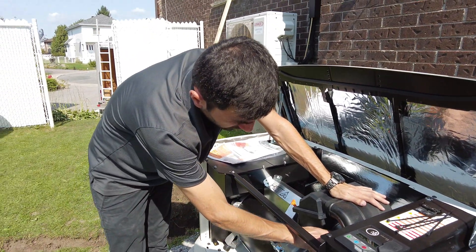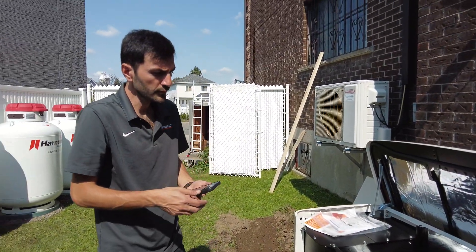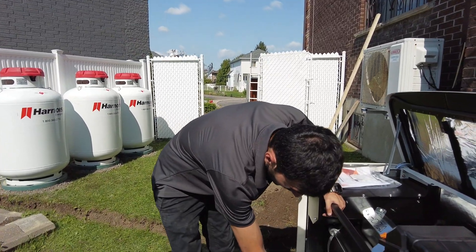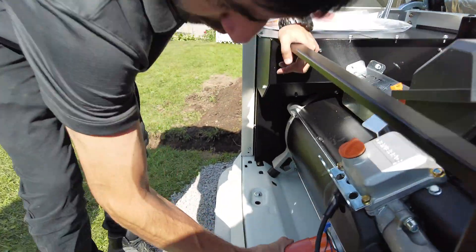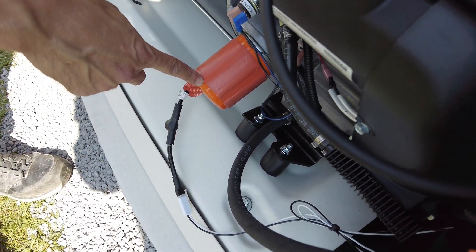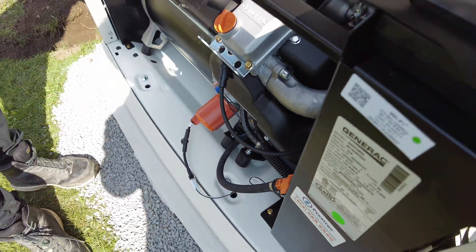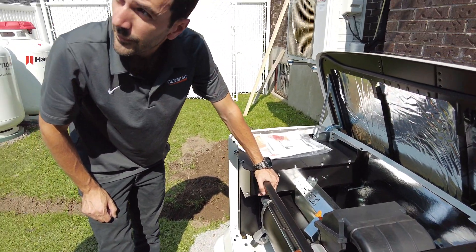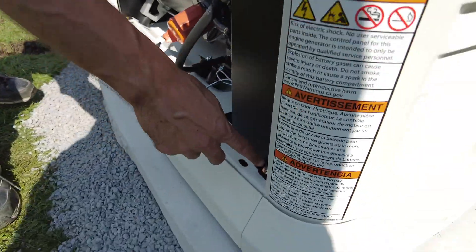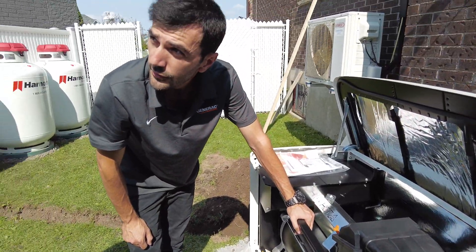When it starts, it starts with half-load. It's a two-cylinder engine. We installed the oil warmer — this is the oil warmer. So the first oil that goes to the engine is the oil in the oil filter. When it's hot, the engine starts easily in wintertime. Same thing for the battery — you see the orange warmer underneath? That keeps the battery warm so it doesn't freeze and starts easily in the wintertime.